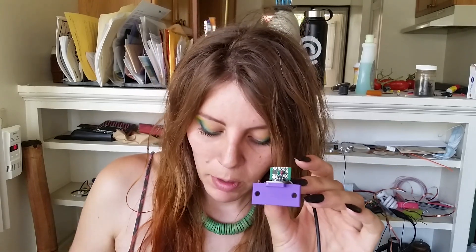It's similar to a roadside speedometer check: markers are a set distance apart, you time how long it takes to travel between them and calculate your speed. Here it works the same way — every time one of the magnets passes by the sensor, it sends a signal to the Arduino with the time in milliseconds it was received.